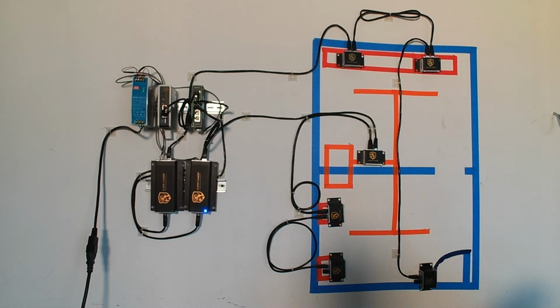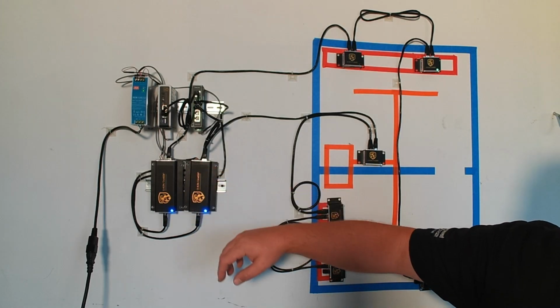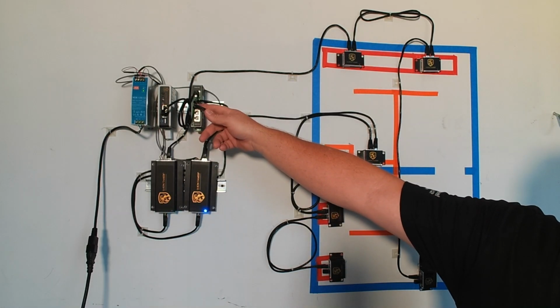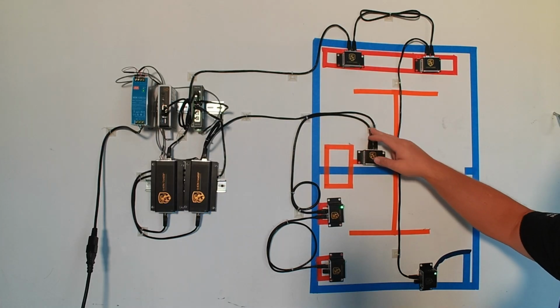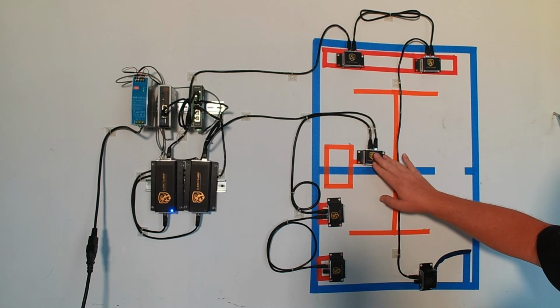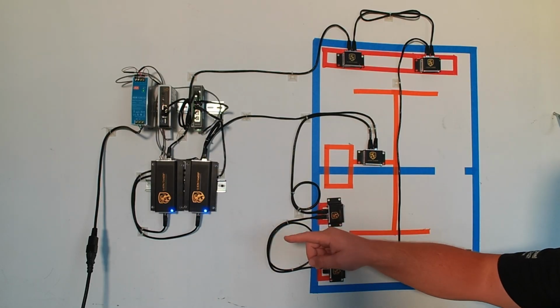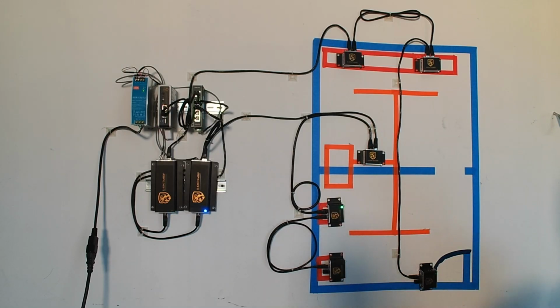All right, we took about 10 minutes to wire it all together here, and we'll walk it through. I said I already had the 12 volts wired in before we started earlier. We have our output coming here and going up to port number 3 on the switch. We have our CAN bus channel A coming over here to in on our monitoring sensor. I'm sorry, this is our reference sensor. Out into our hub number 2, sensor number 1, and then hub number 2, sensor number 2. The rest of it remained the same.